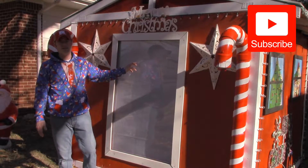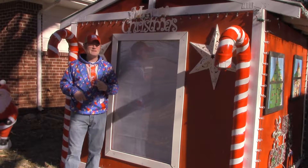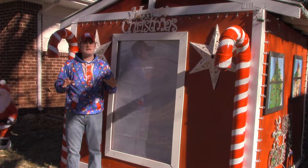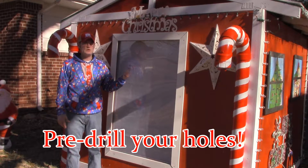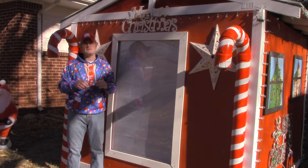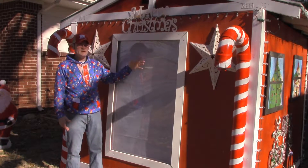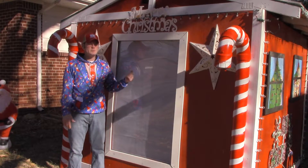The only major thing you have left to do is install your plexiglass. I went to a local big hardware store, got a four-foot by eight-foot sheet of plexiglass, brought it home, and used an exacto knife to cut it down to size. As long as you're slow, methodical, and take your time, you can cut plexiglass with an exacto knife. The two ways you'll instantly ruin your plexiglass: first, if you don't pre-drill your holes for the screws, you will absolutely crack the glass. Second, if you screw it down too tight, it's going to crack. If that crack hits your major viewing area, you'll have to go back to the hardware store and start over. Biggest piece of advice: pre-drill your holes.